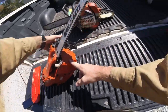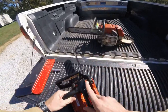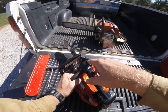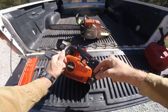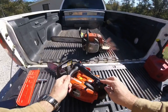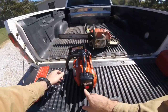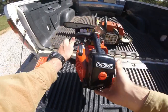The dogs on here are metal, which is good — it's plastic on the front side of the saw body, but it's got metal dogs. Your choke is right here. It's almost like cranking a weed eater — this thing is so easy to crank, especially when it's warm. You pull it one time and you don't even need to choke it. But anyway, flip the choke forward, push the primer a few times just to get the gas up there, then pull it three times or whatever and it cranks right up. After that, pull it one time and you don't even need choke or anything. It starts really easy. For the air filter, just pull this off, take your screwdriver, turn it — it says lock/unlock — pop it off, and there's your air filter to clean.